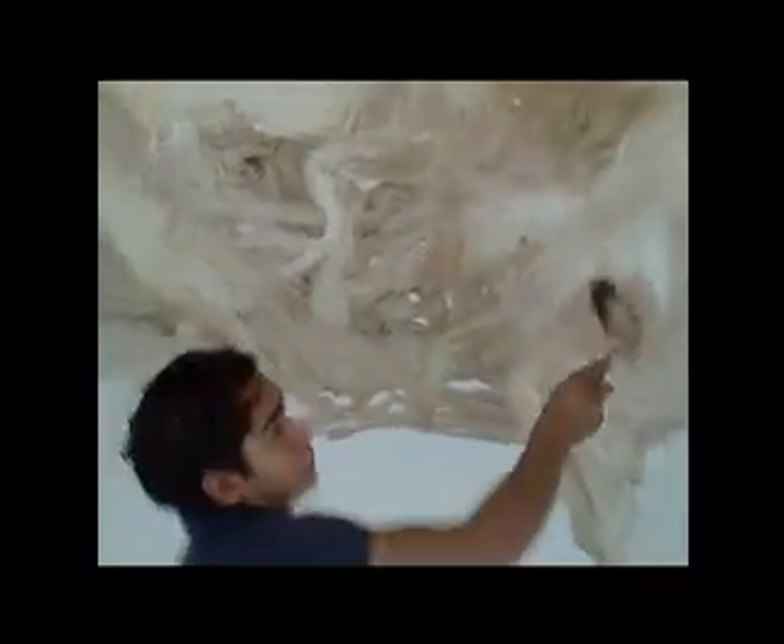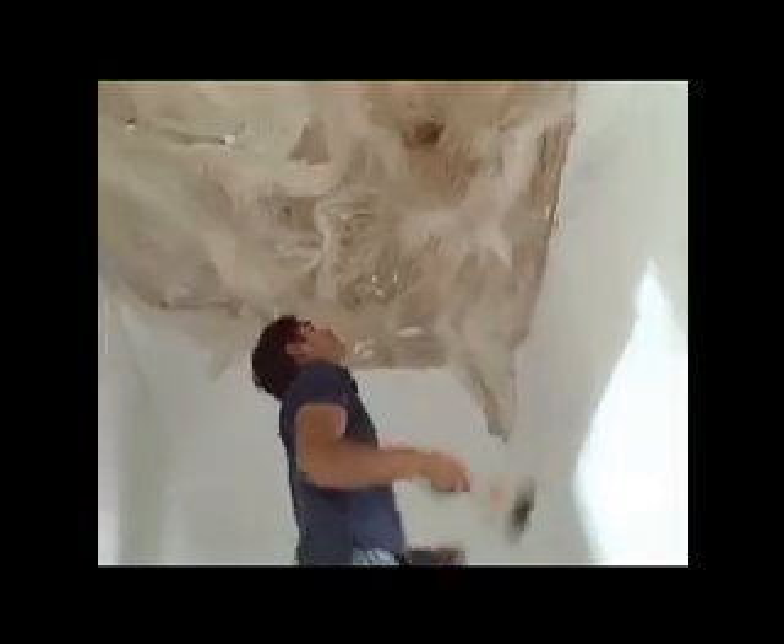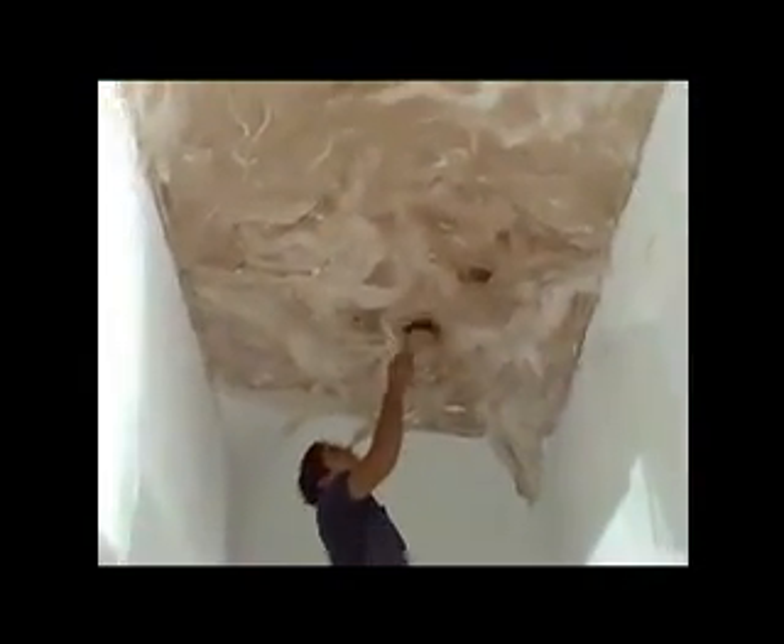The glaze on that ceiling is drying at various rates. You'll see he's working it over and we don't over-badger one area too much. As he goes over some, it wipes some areas out, it softens some, it blends some. You can use the badger in any direction, sometimes in multi-directions or just in one direction a bunch of times. You might not want to hit all areas, basically pushing the material around and softening it at the same time.